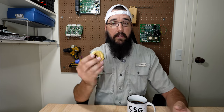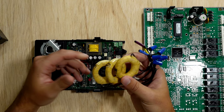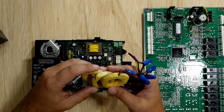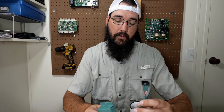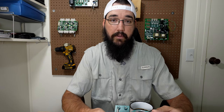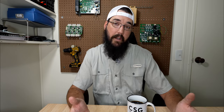What are some different input and output devices? One input device may be a set of CT rings — strictly for current sensing — which wire into a set of inputs on a control board. This gives us the ability to monitor our fan current or compressor current. Another option is this potentiometer, which is a PRV positioning sensor that tells us what position our guide vanes are in on the chiller. Ultimately it's just an input device — it feeds back a signal so the controller knows where that position is and can determine what it wants to do from there.